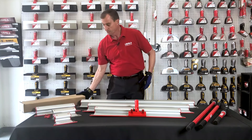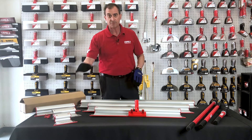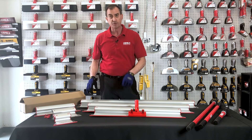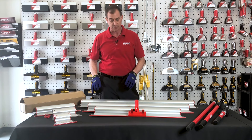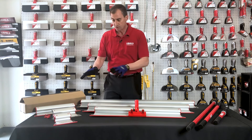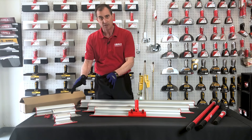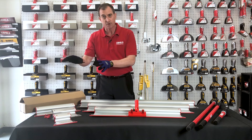So I'm going to go through this full set. That was a 24-inch blade. We have 7-inch, 10-inch, 16, 24, 32, 40, and 48-inch skimming blades — covers the full range. Your 7-inch and 10-inch, you may use those two skimming blades to wipe down behind tape or to do some finer finished work in a tight area.